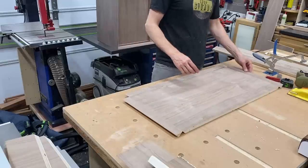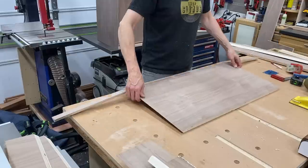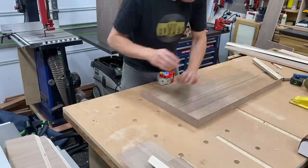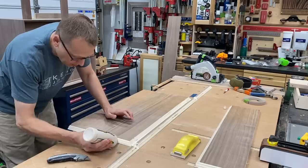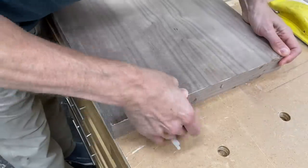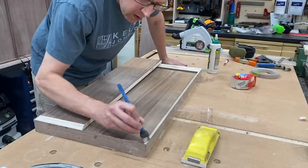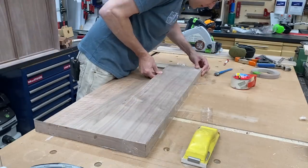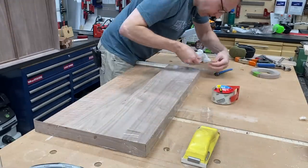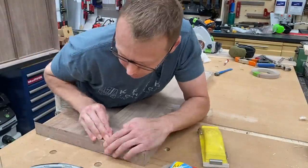Using some clear packing tape, I could start the assembly before glue. As I mentioned in my last video on the faux beam mantle, you can just use clear packing tape and glue — I'm going to prove that here. I'm also proving that I'm kind of a doof because those side pieces should have been taped to the top rather than to the front, which would have made that assembly easier. But it still works. With some glue applied, I can fold those miters and then apply some more tape. You can use blue tape or green tape to do this, but the clear tape allows you to see through and make sure that your joint is coming together tight. My bottom section is a little bit short because I didn't have enough plywood for a full width section, so I'm doing it in two pieces — but since it's the underside of the shelf you'll really never see it.